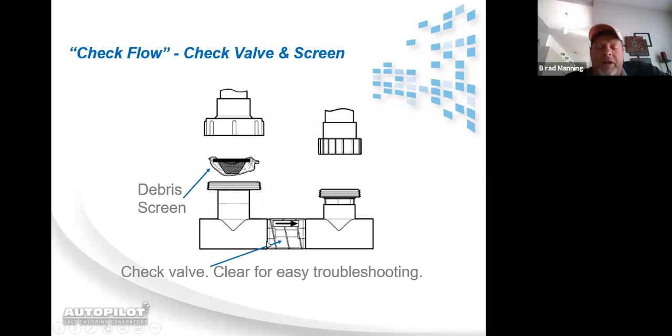pump shuts off. If that doesn't happen, however, you're going to need to replace that bottom manifold, because on variable speed pumps and 2-speed pump applications, we are definitely going to have to work on the lower RPMs or low speed on a 2-speed pump. I highly recommend when plumbing this manifold in that you put unions on each side of the manifold, right up to the manifold. That way you don't have to measure anything for cutting and replacing one. You can very simply glue 2 new union pieces on each side, remove the old one and slap the new one right in place. It's a 5-minute plumb job.